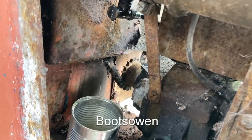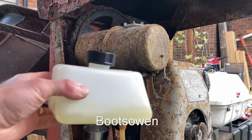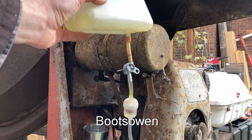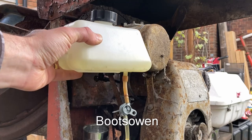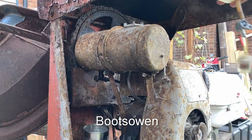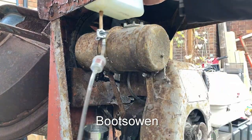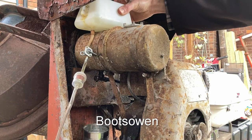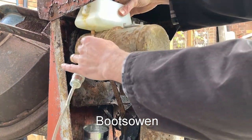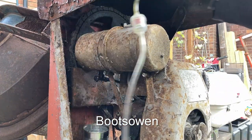I wouldn't even worry about that. What I would typically do on something like that, as I do on other engines, is just put one of these cheap fuel tanks with an inline tap and filter on it, and that way it's not got the same amount of fuel in it, but you can normally just secure it up on top somewhere like that, maybe the other way around, as long as it's clear, won't interfere with the operation of the lid. I might put a longer thing on there and just tie it in underneath to the carb.